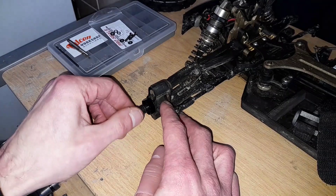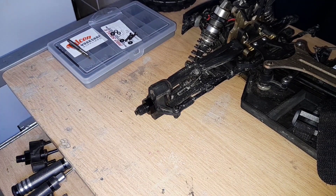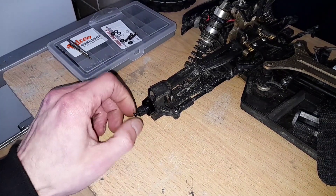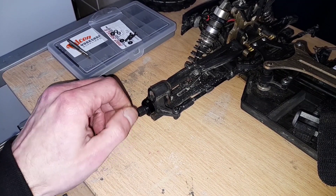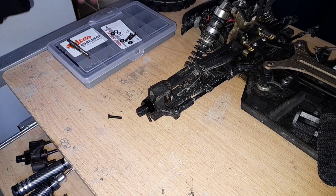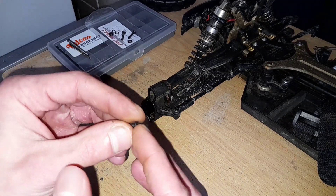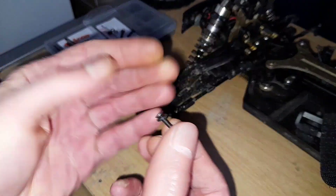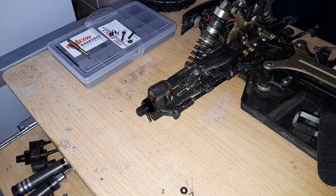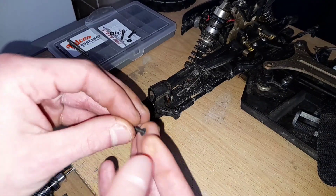Obviously this side hasn't got the issue so I can just pop that out. Unfortunately I was still left with the pin inside. So I took a 1.5mm drill bit and drilled out the centre of that grub screw, then I took a 2mm drill bit and drilled it out some more. Luckily, the grub screw managed to bind to the drill bit and push itself out into the cavity. Because it's such a small grub screw, it just worked out nicely — it fell out.